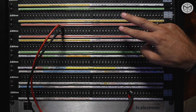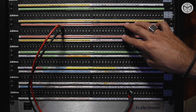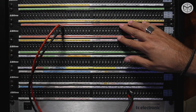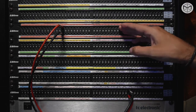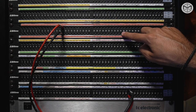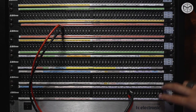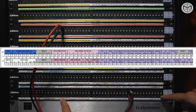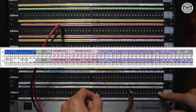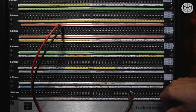The inserts from our SSL channel are hardware inserts, and generally this patch is always open or through, because this might vary between a mix and a recording session. You don't want to normalize the output with the input — just leave it as free as possible. This last few patch bays also feature a lot of our external preamplifiers, outboard gears, compressors, external EQ, and effects — so we want to be free to move our patch cords however we want.